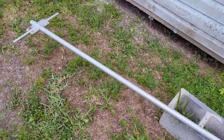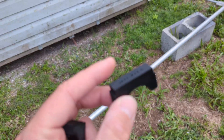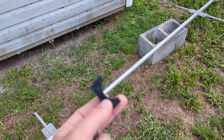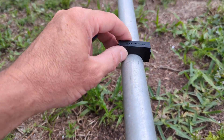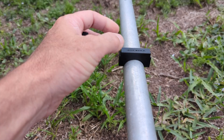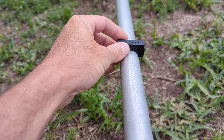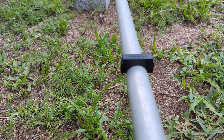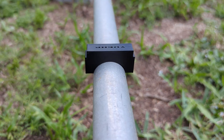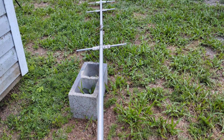Here's what I'm doing — I'll show you inside in a second. I've been 3D printing some options. I found some of these online for free and I've been modifying them. I think I have these just right as element holders for this antenna. That one doesn't fit quite right, that one almost — see? I'm trying to get it snug on there, and then I can epoxy it and the element goes on top. So I'm going to have maybe 40 or 50 elements on this thing.